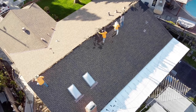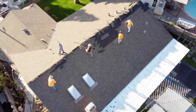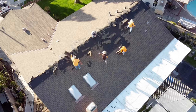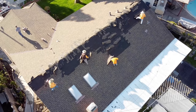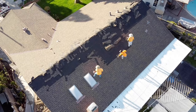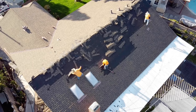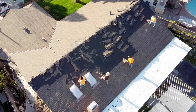So we went ahead and ripped off the single layer. You always start at the top and make your way down, and start at the back of the roof and walk your way forward. When you're tearing off a roof you get all kinds of shingle grit and granules that land on the paper and it makes it extremely slippery, so you want to do the least amount of walking as possible.